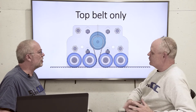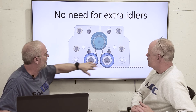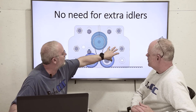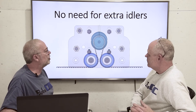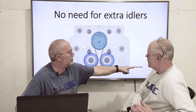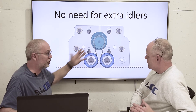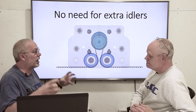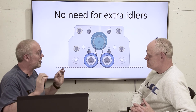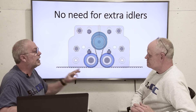There is not a lot of difference at this point. We need a lot of teeth engaged around the timing pulley. The only thing we're doing with the timing pulley is trying to get more teeth engaged. You can imagine on this simple design — if it's fixed on both ends — as soon as you turn the motor, this whole thing has to move back and forth, so you get your linear motion. For the E3 and E4, lightweight CNC machines that don't have a lot of weight or inertia, this is a beautiful design. It's cost effective, it's simple, it works well.